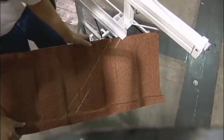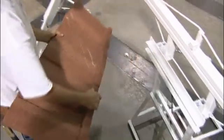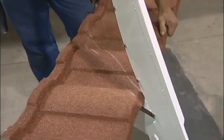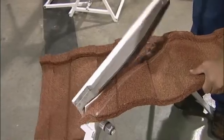Place the nose of the tile in the bottom footbender and flatten it, and do the same thing for the top flange. This will make the tile easier to cut, and you'll have to do this for every tile you cut. Open the blade of the cutter all the way, push the tile up to it, and align for the cut. Cut about three quarters of the way through the tile, then reposition it and chop through the rest.